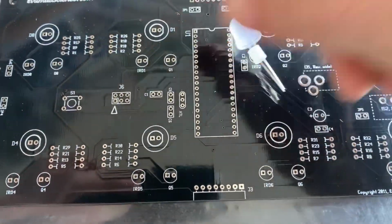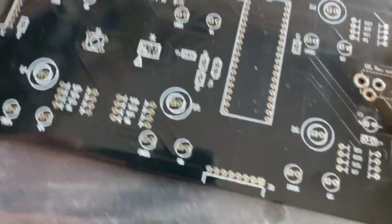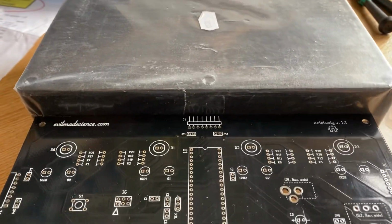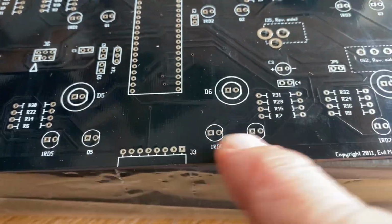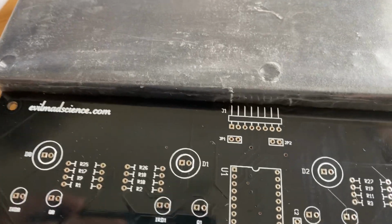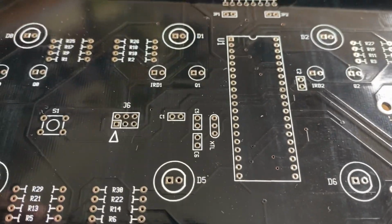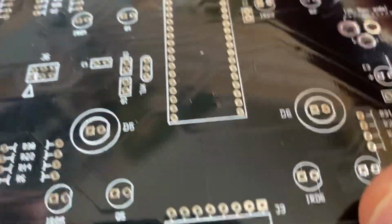So I'm saying, get your standoffs on, put your LEDs in place so that they stand off nicely on the board, and then when you mount the board underneath, they'll all be set up at a nice height, and the IC won't be holding the sensors off from the holes in the box. Because if that was set back and your LEDs were mounted directly to the top, the distances wouldn't be set that well.